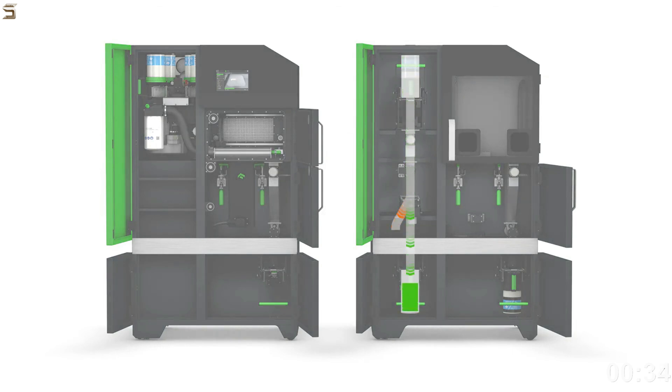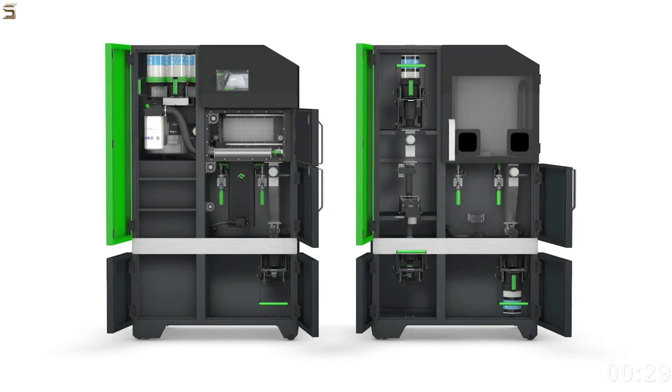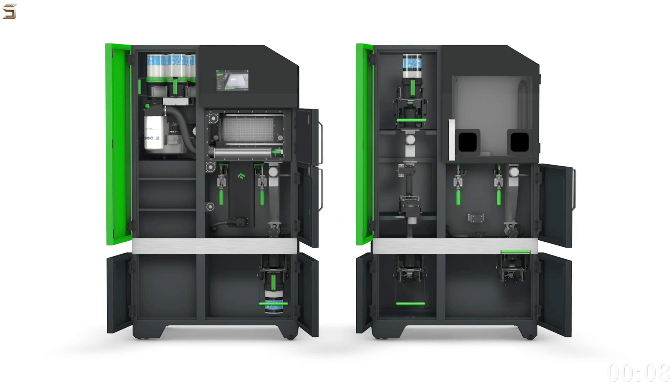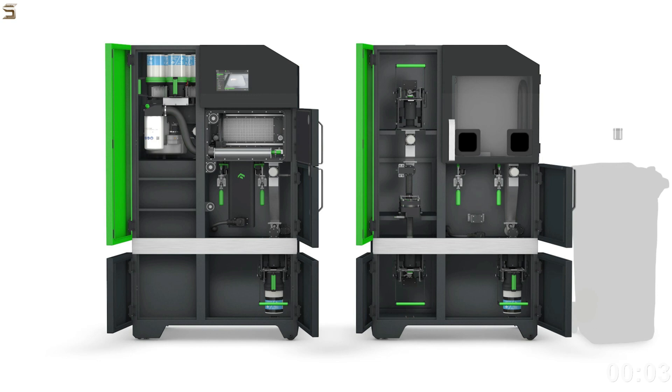It comes with the M-Prep program. The depowder station and printer both use cartridge systems, so handling powder is a breeze and you won't come into direct contact with it at all. You can efficiently remove surplus powder from the unpacking chamber with the side connector for a vacuum cleaner. The M-Print Plus printer comes with a single 200-watt fiber laser that produces a 45-micron spot size, with a scanning speed of up to 3,000 millimeters per second, making this reasonably priced metal option also fairly quick.